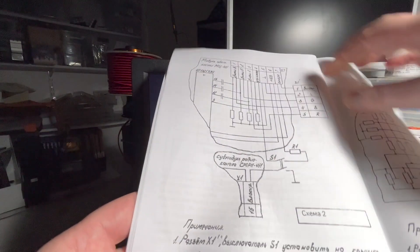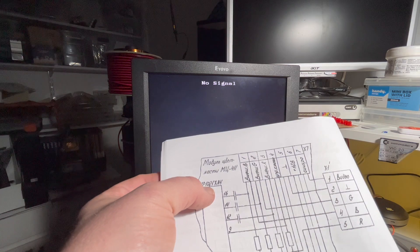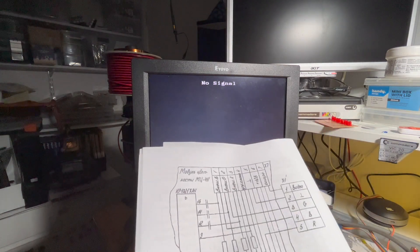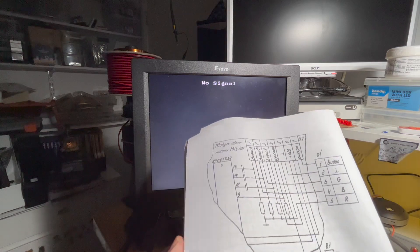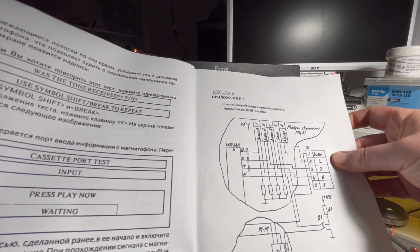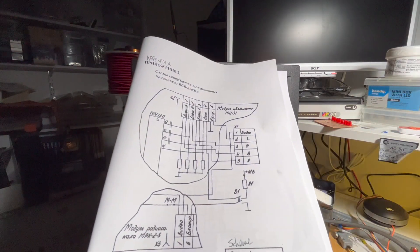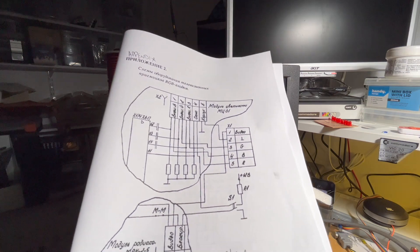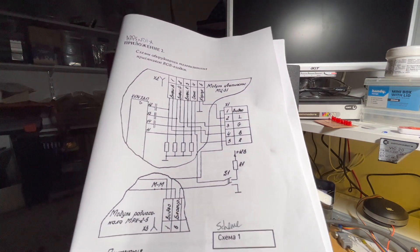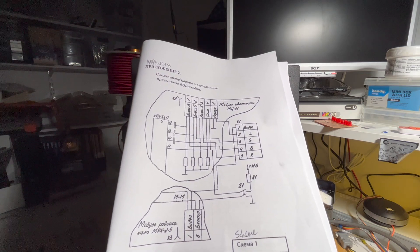There's also a reference to a KR1021, and I have a KR10 — that's a different ROM and a different size. So maybe that's the first model of this machine. We've got reference to the RGB output and again plus 12 volts — where's this 12 volts coming from? I don't see any DC-DC converter on the board, and the power supply definitely says it's 5 volts, not 5 and 12. Unless it does also output 12 volts and there's 12 volts missing.